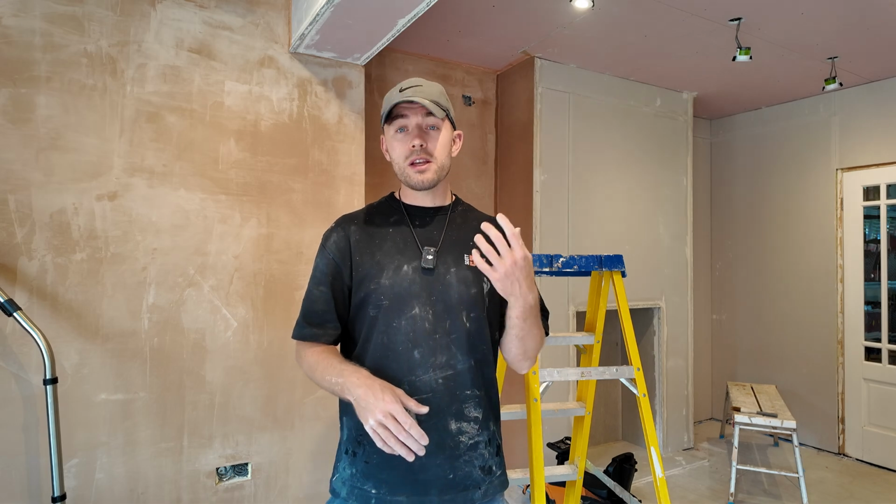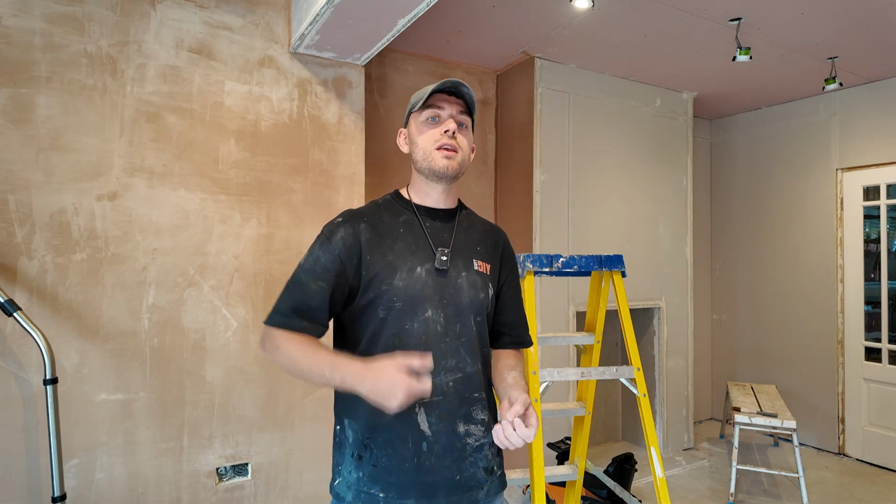And then you let it go really hard, and that's the point where you can flick some water on the surface with a brush, and then you can literally get the second trowel out again and just go over it and just keep going over it until you've got something that you think is absolutely perfect. That's like your last chance. So for me, that's what's been working.